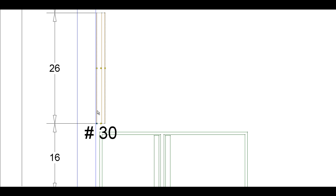Now if you're dead on with your measurements and you have it exactly a 1/4 inch from the edge of the filler to the wall, then great, good for you. But let's just say that ends up being a 1/2 inch. Well, you'd have to either order another filler, or the Scribe Molding just covers up this gap, and it's a very professional way of doing it. So just take a look at our Scribe Molding material there. It's very cheap to order one, and you'll be good to go.